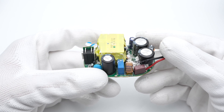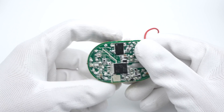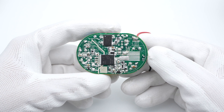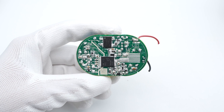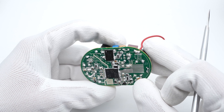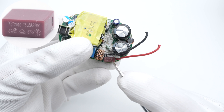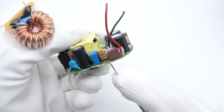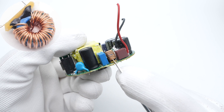The two most obvious chips on the back are the bridge rectifier and the power IC. The exposed copper trace can facilitate heat dissipation of the power IC. ChargerLab found that it adopts flyback topology and synchronous rectification for output. The input fuse is a wire fuse, 3.15A, 250V.